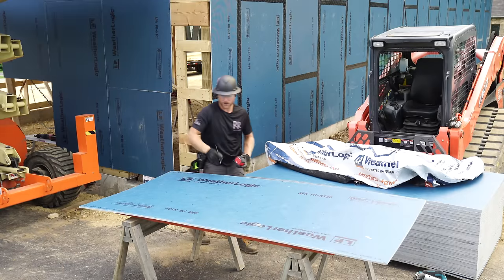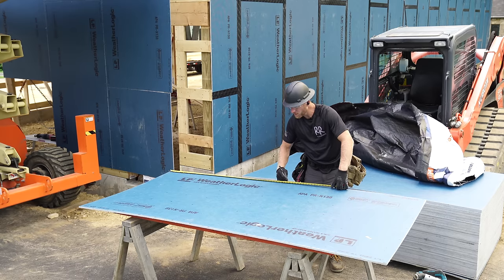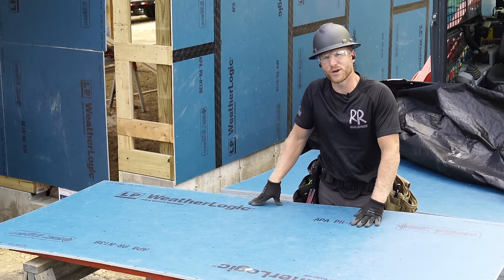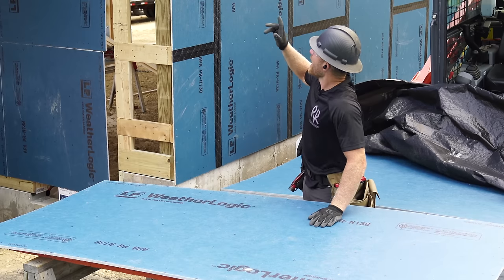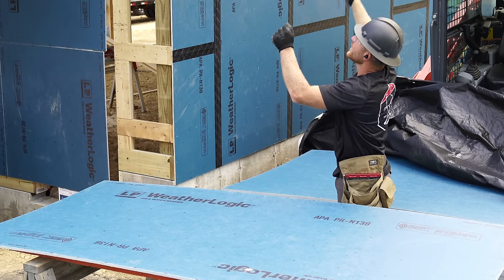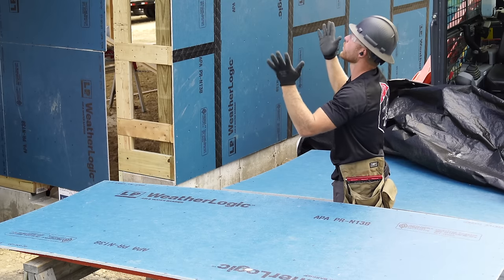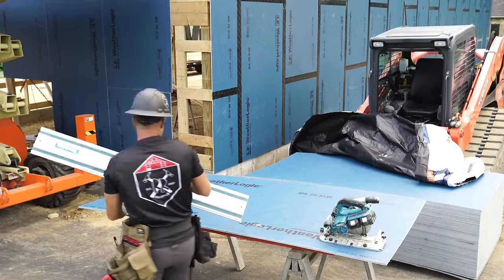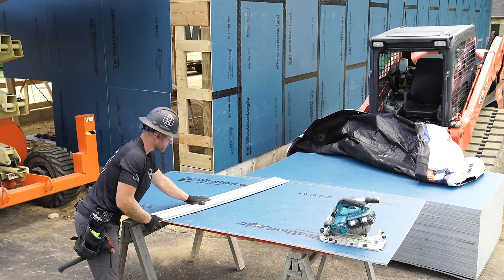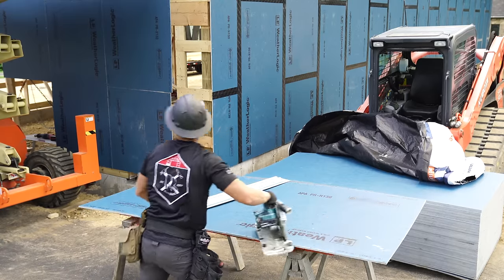This sheet, I'm still going up the angle. I've got 34, which is 2 foot 10, and then I'm going to go 3 foot 10 plus 4 more inches — 4 foot 2. I remember when I started construction and didn't really know much math or how to apply it to the job. I'd grab a tape measure, get my left measurement, measure over four feet, measure down, eyeball where it had to be, come down and make those cuts — and they weren't perfect. If somebody had said in school that this math was actually going to be very helpful if you become a builder, I'd have paid more attention.